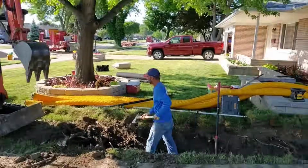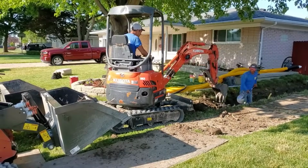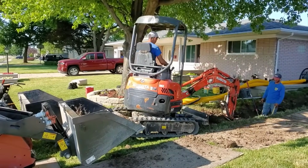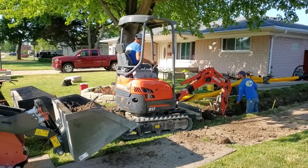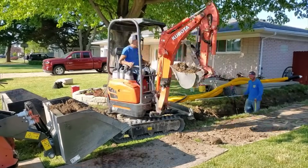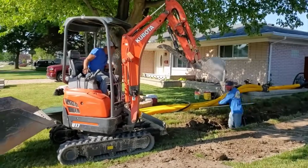So you can see Valentine over there chopping away at those anchoring roots. Do not worry about that. Contractors, your clients are going to ask, is that going to kill my tree? No, they're anchoring roots. The roots up near the surface are anchoring roots. You would have to cut them all off all the way around, and yes, the next big windstorm would blow the tree down. But cutting roots on one side of the tree is not going to be a problem.